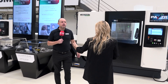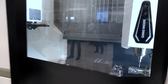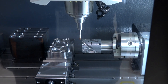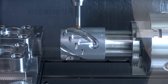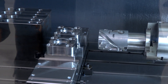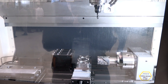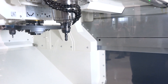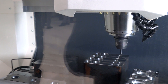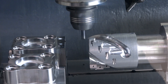Previously there was the M1, launched in the UK a few years ago. Now this is the M2. The M1 had 550mm in the X-axis; this has over a metre — 1.1 metres in the X-axis, double the size. You can see they're making the most of the table, with a fourth-axis unit and more components on it. That larger X-axis gives more scope for larger parts and multiple parts. Interestingly, 50% of the people who bought these last year were new customers to DMG Mori, so they're hitting a new area of the market.